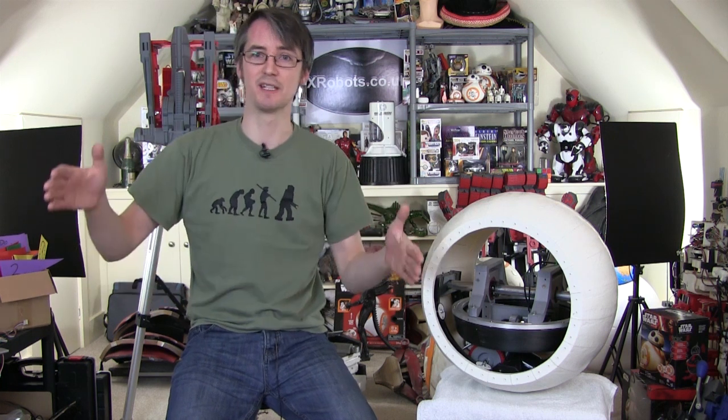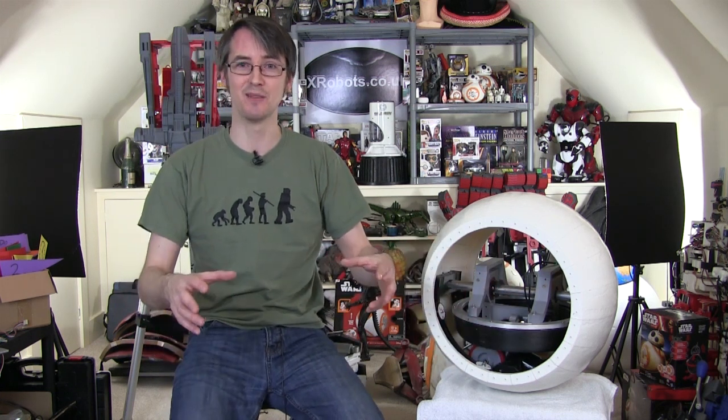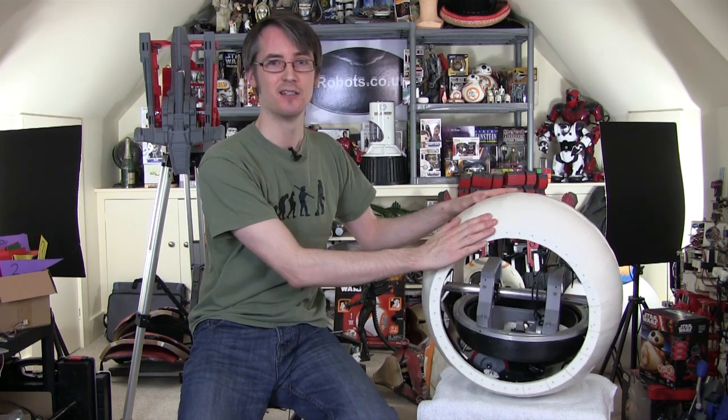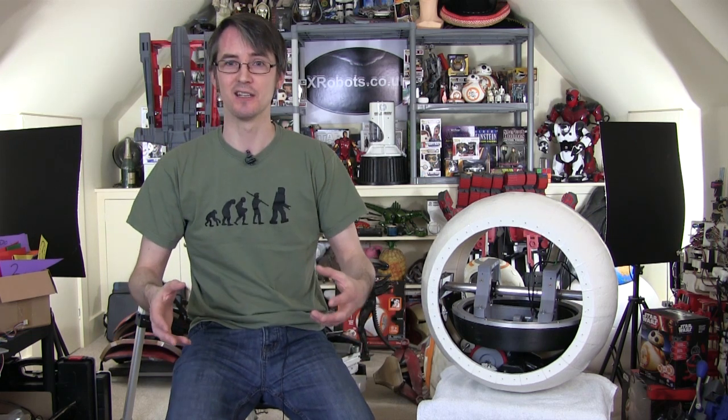So it's going to be mainly used side to side for stabilisation, which I didn't have in version 2, which is why you always get that wobble, which I can now get rid of. And the whole thing, as I say, is going to be stabilised with an inertial measurement unit, both for driving and for the side to side. And then I've got the flywheel for spinning, which isn't stabilised, but in all I've got three axes in my ball. So forward, back, side to side, and the ability to spin. So that's an extra axis from version 2. I've then got three axes to implement in the head, and then that's all six axes, so the controller's going to be quite a lot of fun for this one.